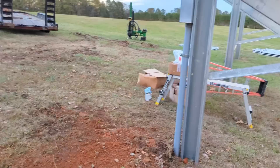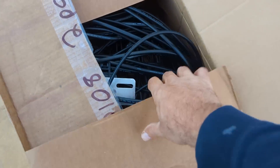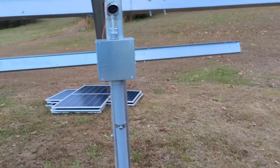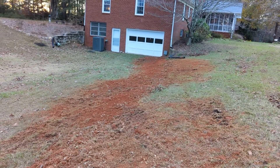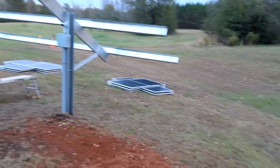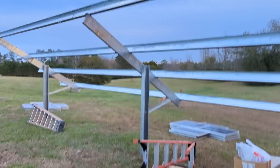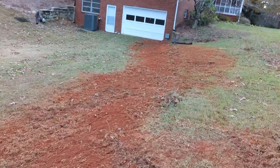We pulled our wire in here. I had a lot of scrap number eight, so we just used that and we're going to make a junction in here from the Q cable. We'll make connections in there, run two circuits into that box, then hook up with our Romex — a 12-2-2 — giving us two circuits with our ground. The combiner and everything is over there and I'll show you that tomorrow. We did pretty well today. Yesterday was a rain-out, but we'll build this tomorrow and pull the panels up. Finally cleared out — beautiful cold, good working day.